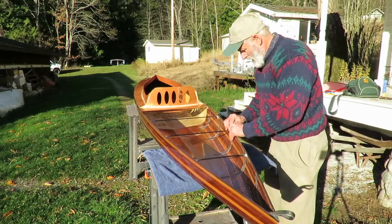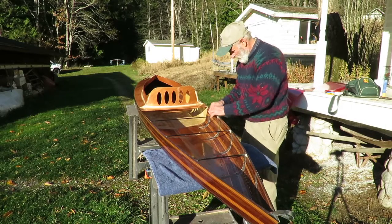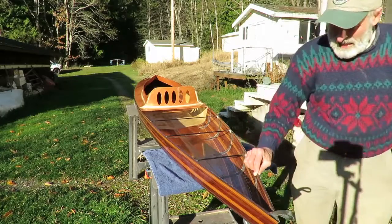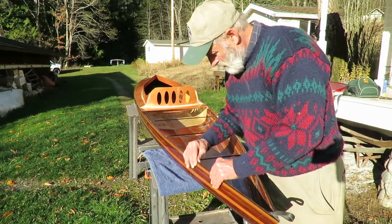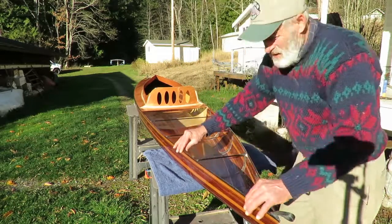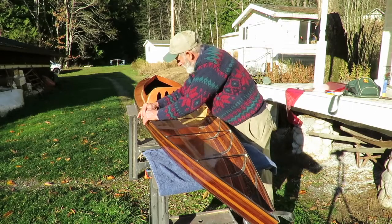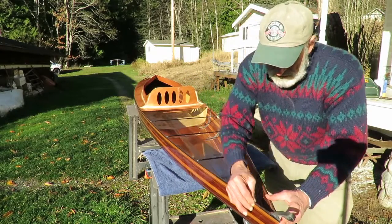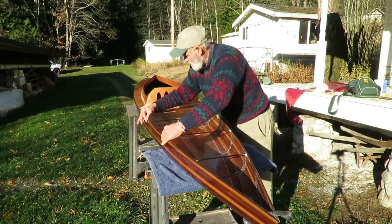So there we go. And so now the double-sided orange backed tape will be underneath the black vinyl tape. That should be totally compatible and not cause any problem at all. Okay, you just want to make sure the black vinyl tape comes down on the outside far enough to cover the edge of the double-sided tape. But that shouldn't be any problem because the black tape is 1/2 inch wide and the orange tape is 3/8 of an inch wide. So you have 1/8 of an inch of leeway there. And the black tape on top will stick incredibly to the orange tape. You never get them apart. And the orange tape will stick incredibly to the hull. Okay, try to have that pushed down tight everywhere. The orange backing is still in place everywhere, of course.